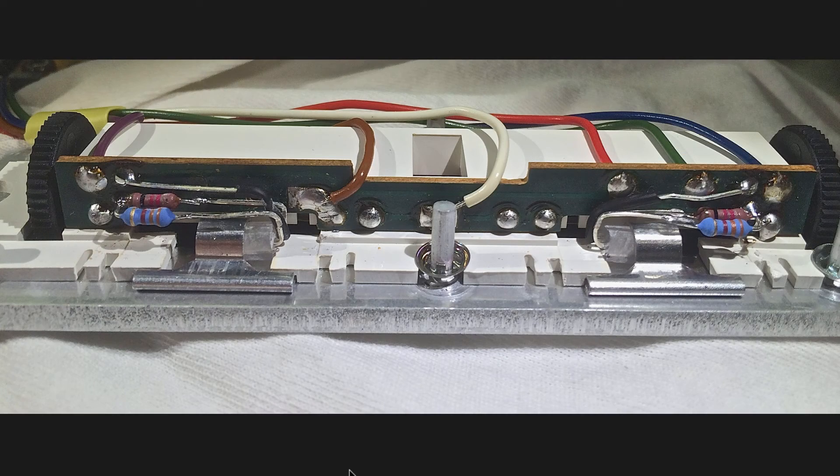Here you see my implementation of the red-green LEDs. In fact, I used red-blue-green LEDs but cut off the leads to the blue LED, because we don't need blue to get an incandescent glow. These are my two resistors: one is 3.3 kOhm and the other is 1,000 Ohm. The green LED runs on the 3.3 kOhm resistor and the red one on the 1,000 Ohm.